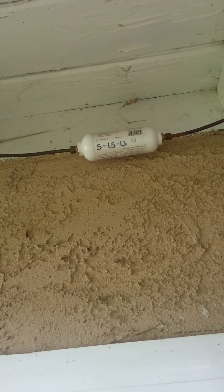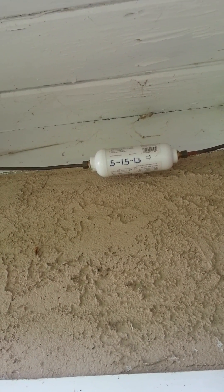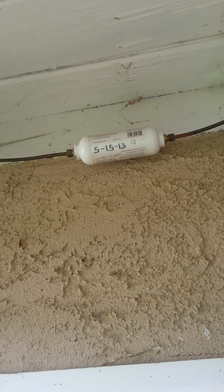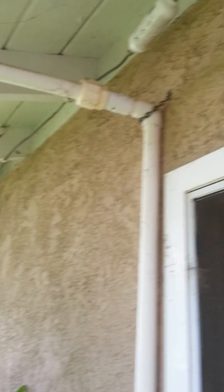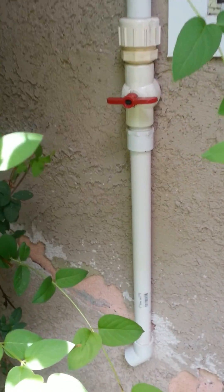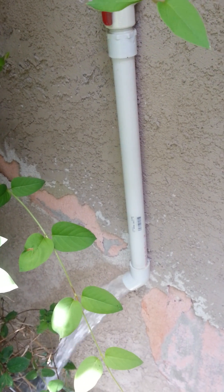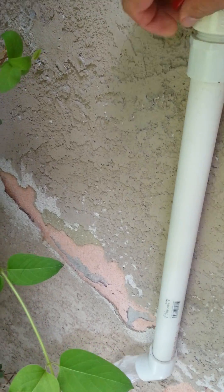Here we are in the backyard. What you're seeing here is the water feed line for the swamp cooler. I have two filters that I put in on May 15th last year. These two filters help remove minerals from the water line so that I can get less minerals going into the swamp cooler itself. And over here is a drain — a one-inch PVC pipe. In the morning with the pump off, all I have to do is come out here and let this run until the water slows down. At that point, the pan of the swamp cooler up on the roof is empty.